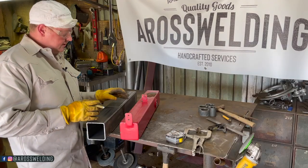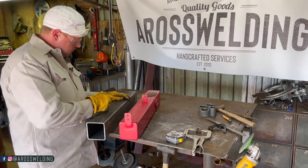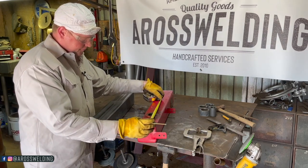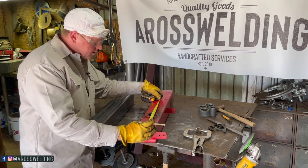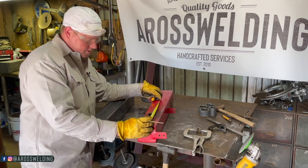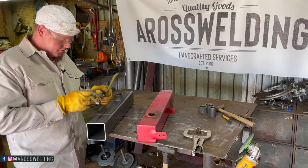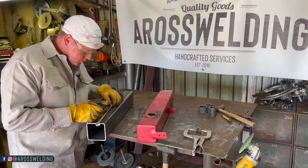Next thing I'm gonna do is lay out these holes. I'm gonna make a note that I want my plates right here. Go ahead and lay this one out, keeping in mind that I'm gonna be adding a quarter inch plate here. I'm gonna say we got 5.5 to the center. This is what we're putting back in here. 2.5 is the outside diameter, also known as OD. So half of that is 1.25.